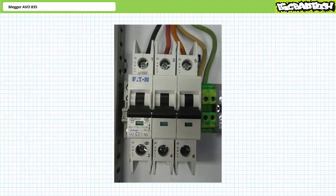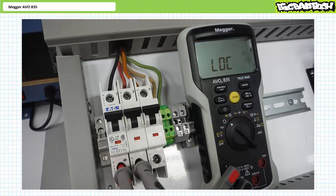Consider a three-phase AC system of unknown sequence landed on a three-phase AC circuit breaker. The colors black, red, and orange might or might not mean something to somebody, but they don't mean anything definitive to you — it could be any sequence. The black wire lands on terminals one to two, the red wire on terminals three to four, the orange wire on terminals five to six. Ignore the terminal numbers; let's simply concentrate on the colors: black, red, orange. Let's choose the central red wire as our reference — this will be two.